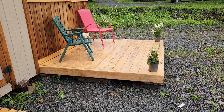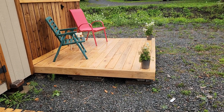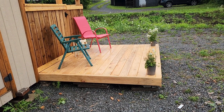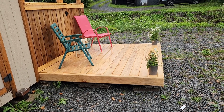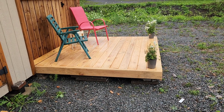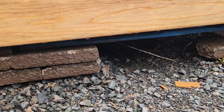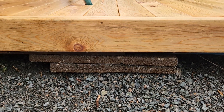What you want to do is lay your pallets out. You want to get some patio stones — which I also got for free from a site that was discarding them. You can break larger ones into smaller pieces to support the corners of your pallets and the transition points where pallets come together. Get patio blocks underneath all the corners, then level everything up with gravel. I'll show you underneath here — it's all on pallets supported on blocks.